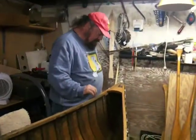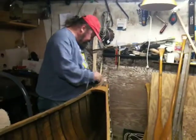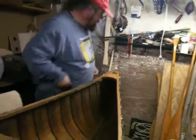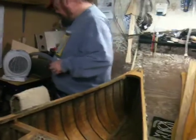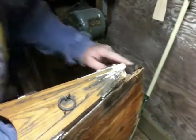But you hear the difference. You hear one and you come up here and you can hear and feel the punkiness. What was the fingernail test that you mentioned before? Oh, you stick your fingernail right into the wood. It's soft. You can tell it's rot. That's how we were telling up in here before. And the good wood goes to about there.